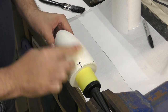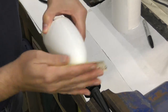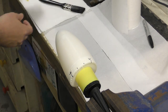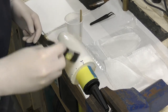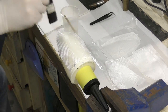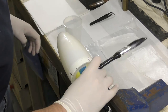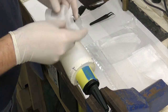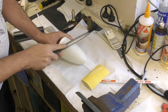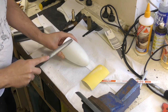To build the prototype we start with the nose cone. We 3D printed a thin-walled nose cone without any infill. This gives us the right shape but it's not strong enough, especially during landing, so we reinforce it with fiberglass. We add three layers of the 85 gsm cloth — it conforms really well to curved objects. We also add a few layers over the tip. The next day when it's cured we give it a bit of a sand. Because this is only a prototype, that's good enough for now.